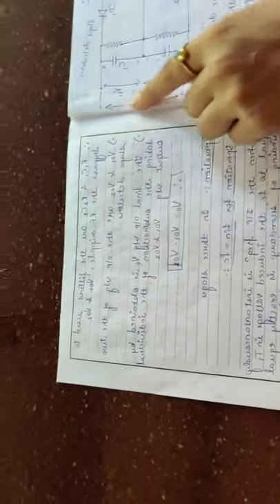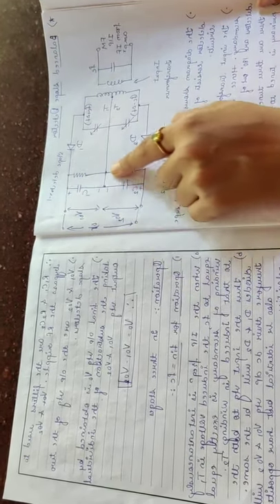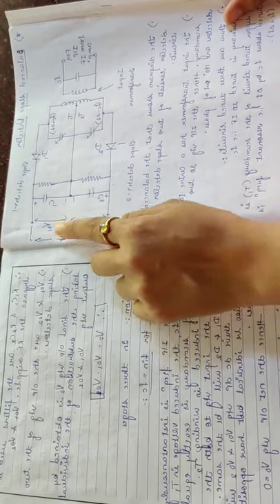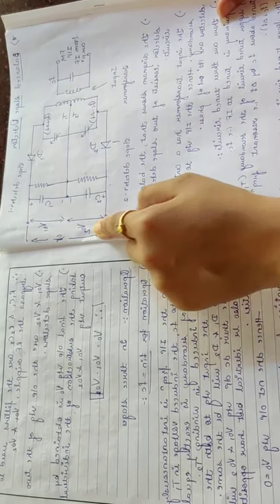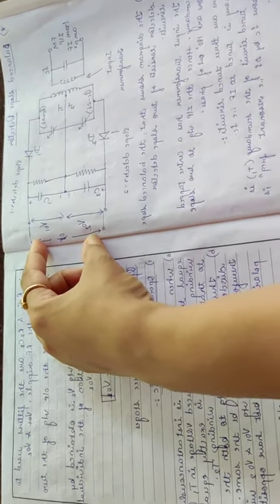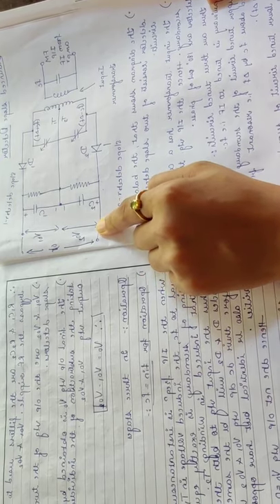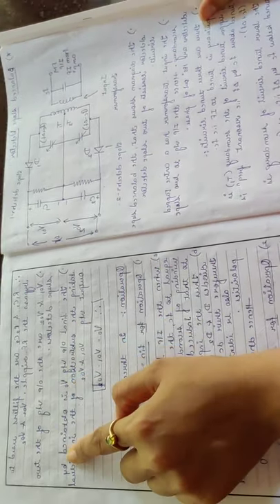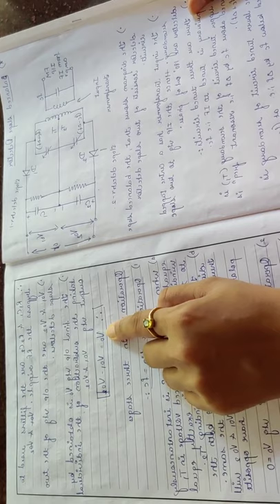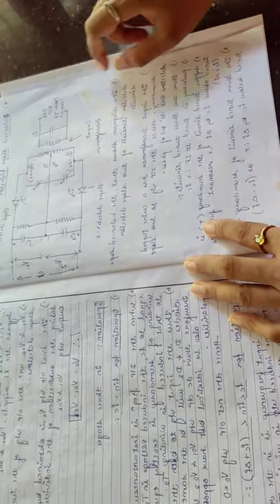In the circuit, R1, C1, R2, and C2 form filters that bypass the RF ripples present in the circuit. V01 and V02 are the output voltages of slope detector 1 and slope detector 2 respectively. The final output voltage V0 is obtained by taking the subtraction of the individual output voltages: V0 = V01 minus V02. This is the basic circuit of the balanced slope detector.